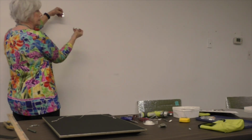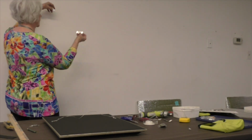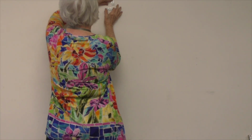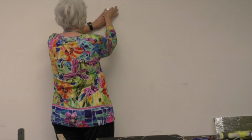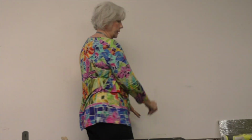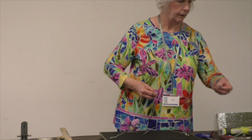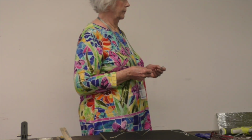So the wrench will fit behind the painting and tighten. I'll show you that in just a minute. This is on the back of the painting, this is on the wall. And the way it hangs, I've got this backwards, Bill. It's this way. That's on the wall like that, so the painting will just hang like that. And then the same thing on the bottom center. So when you put it on the bottom, you turn it the other way, and then put a little key in it, and you can't lift it, you can't pull it down, it's stuck both ways.